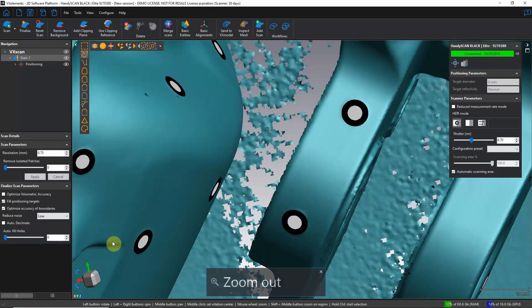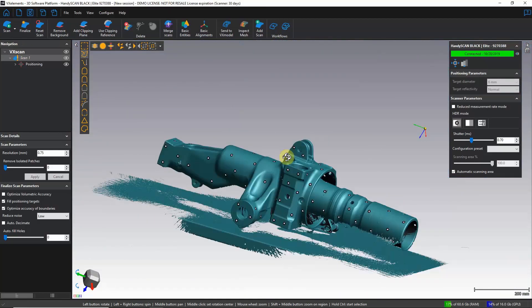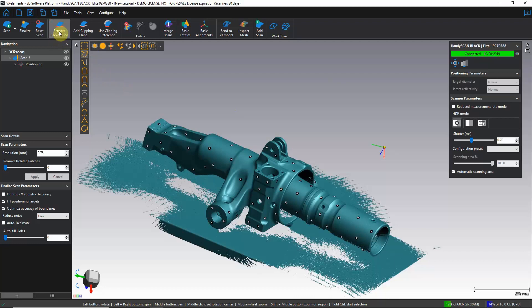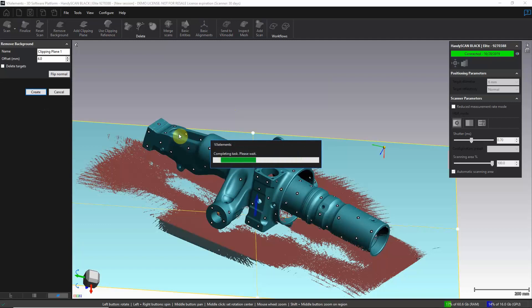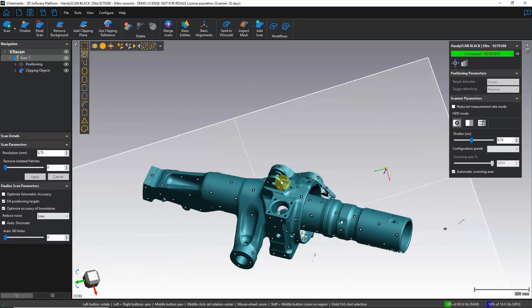Now I've stopped the scanning process, and because we're scanning directly to mesh facets very quickly, you see that the scan is ready for editing. Using the Remove Background wizard, I can quickly remove all of the data from the table below. I increase the thresholds because the table isn't particularly flat, and we create a clipping plane — it automatically detected a flat planar surface, inserted a clipping plane, and I told it to bump four millimeters off that surface. And we've trimmed that all off. Now I'm going to flip the part over, repeat the process again, and merge the two scans together.